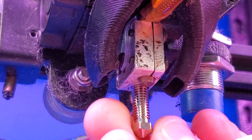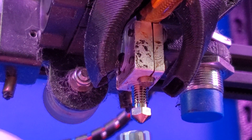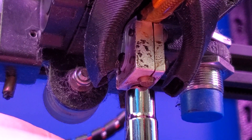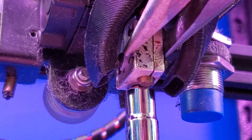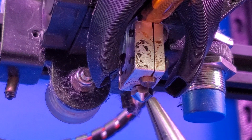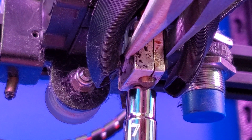When you put the new nozzle in, you can start it by hand, especially if you're working with a volcano like this. Usually right about when it starts getting warm, you won't want to touch it anymore, so thread it in with your socket. You can see the heater block wanting to turn, so at that point you'll need to grab the heater block — making sure again not to hit any wires — and tighten the nozzle down. When using copper nozzles, don't apply too much force because you can damage the nozzle or even shear it off in the block. The same applies to brass and steel nozzles. Just give it one more snug tighten.